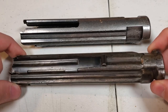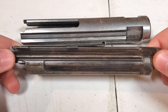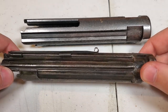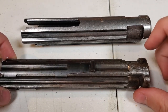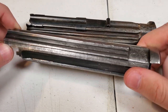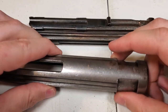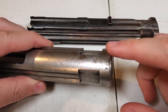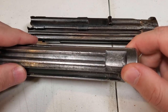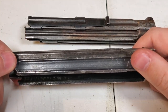So this is probably the worst thing the Germans did with the G43: introducing the stamped bolt housing. These are much weaker and much more prone to cracking and breaking. In fact, if you shoot yours enough, the bolt housing will break. Originally these were supposed to be made out of a solid piece of milled steel, which is much stronger, much thicker, and definitely much better at standing up to the abuse of firing it, because this gun does have a slightly violent action. You really need this strong piece of milled steel to take that abuse.